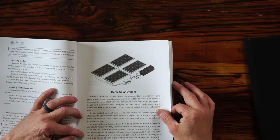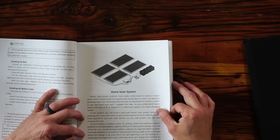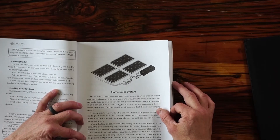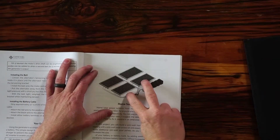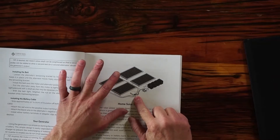It's a little complicated, but it's really easy math. 35 amp hours of electricity from 100 watts — figure out how much you're going to use and build the system accordingly. A 100-watt solar panel can charge a 35 amp hour or 420 watt-hour 12-volt DC battery in a single day of sunlight, and a 400-watt solar array can charge four of them for a total of 140 amp hours or 1.68 kilowatt hours of stored energy per day — not a bad return on a modest $850 investment. The way they've got it set up is four solar panels going into a charge controller.